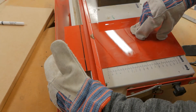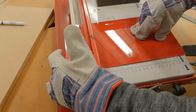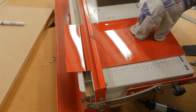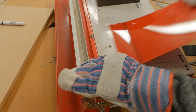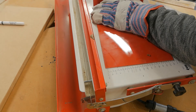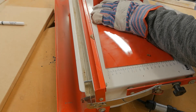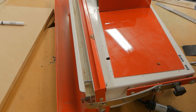Gently you can just feel if it wants to go — it's still very stiff at the moment. It's starting to warm up; it doesn't take long. There — can you see that? There's the memory in the material as well. That's good to go. Quickly get to my block, press it up, keep it nice and compressed, and let it cool in position. About 20 to 30 seconds to allow it to cool. And there you are — you've got a nice 90-degree bend in your plastic.